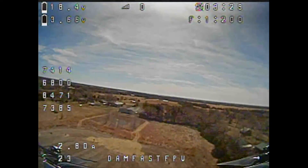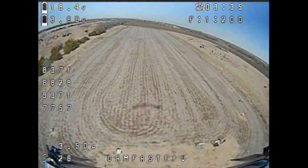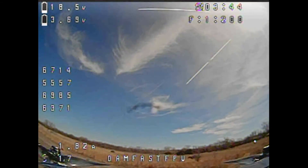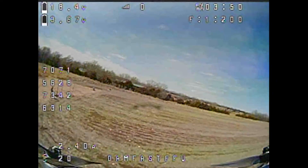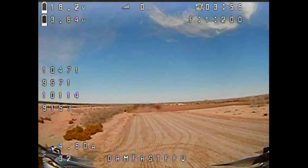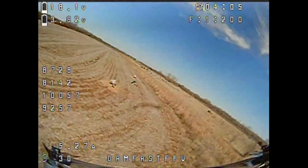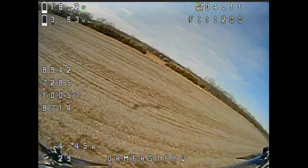So I'm going to show you how efficient this thing is. If I can get it down here to hover — it's pretty much at 2 amps or below to maintain a hover. There we go, about 1.85. Something like this would probably be good for a long-range setup — throw a Crossfire on there with a high-output VTX. You're not going to be carrying GoPros, but you can sure go a long ways and be real quiet about it, and you're below the 250-gram mark.